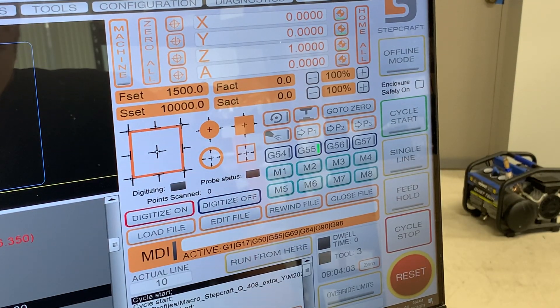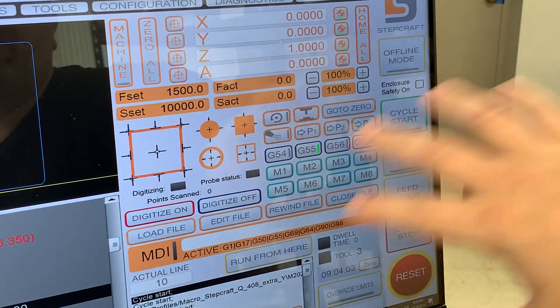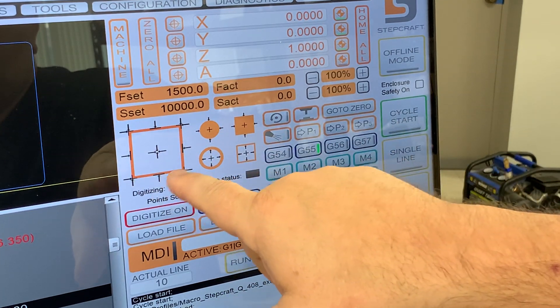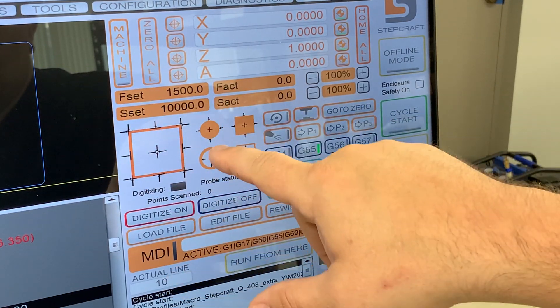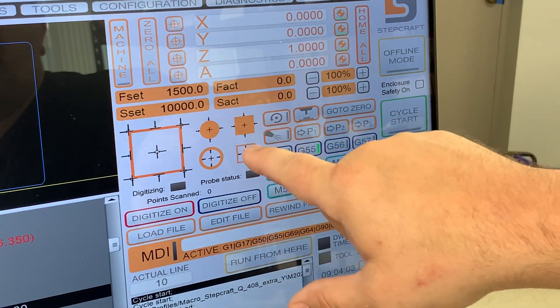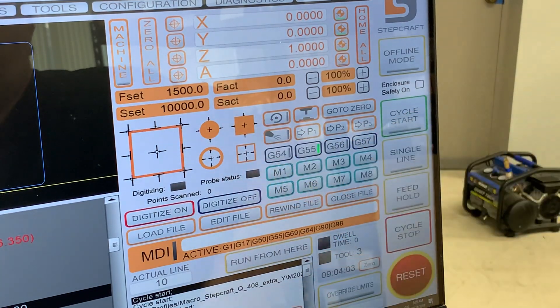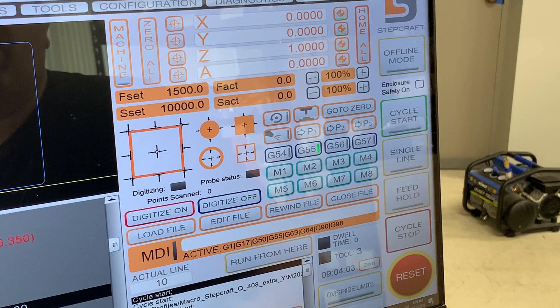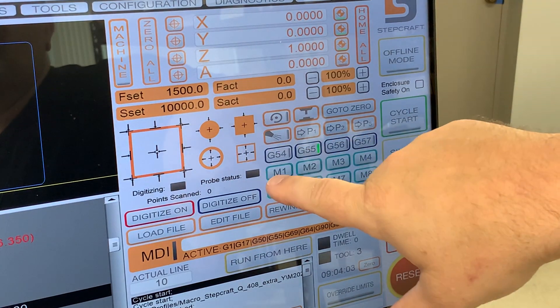Now all I have to do is load an end mill for my job, and I know the center of that end mill is going to be perfectly located on the center of my stock. This touch probe is working with UCCNC, and as you can see on the square box, there are arrows that go all the way around, allowing you to touch off on various points along a workpiece. You can also probe off the outside and inside of a circle and a square, do digitizing for 3D scanning, and bed leveling. All of these macros are available for UCCNC, and probe macros are available for Mach 3 as well. This touch probe is designed to work with any CNC using the tool length sensor or probe circuit.